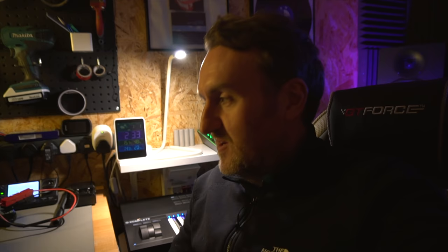Even if you calculate it at a higher average voltage like 14.4 volts, you get around 22.2 amp-hours. The thing is you never know the exact average voltage under load — the more you draw, the lower the voltage sags due to internal resistance, so the less watt-hours you'll get. Discharging at a low rate gives you more energy. I'm happy with that anyway — this pack has probably done about 50 cycles now, and a couple of times it's gone down to 10 or 11 volts which is a bit too low, but overall it's held up well.